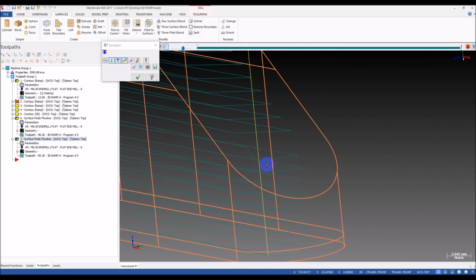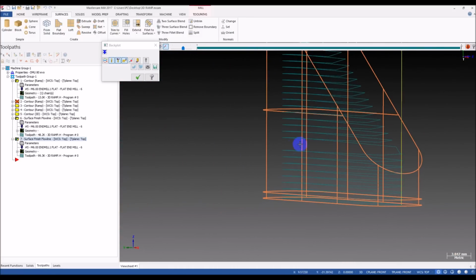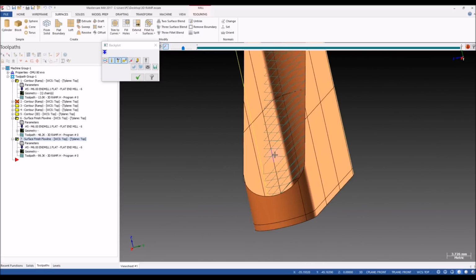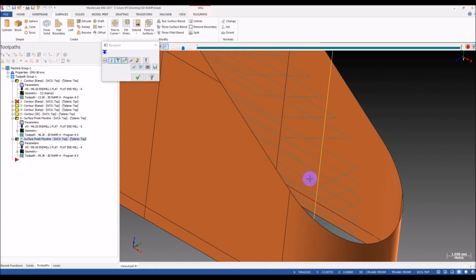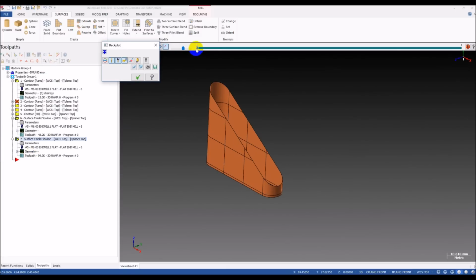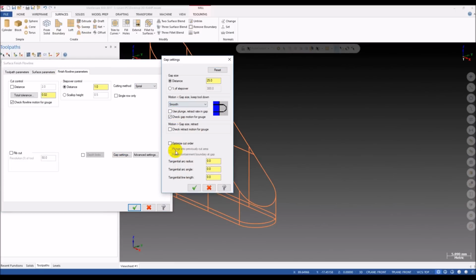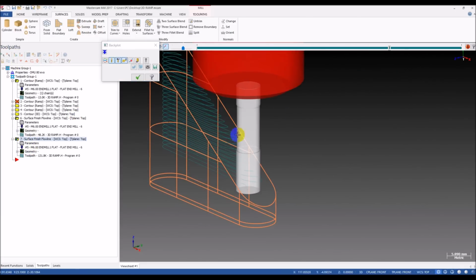Yes, but there's still a problem here. You can see it looks nice, but we still have a problem here. There is no step in this area, and we have a shortcut here, so this is not perfect. You can see the problem right on the dangerous point when the line contacts the arc. It does not give us a good toolpath. So you can change to a gap here and select smooth, so you can have a smooth transition here.